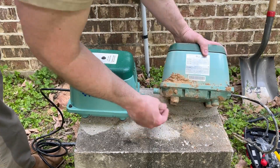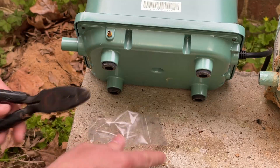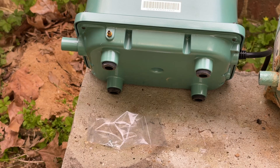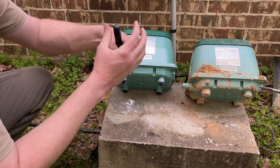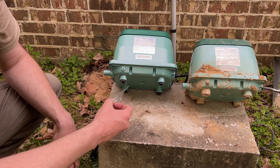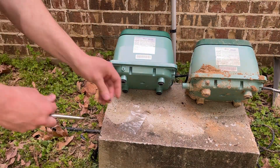On this pump on the right there is a bolt that has run into a bypass port. The new pump came with a brass fitting. If you put your finger over the main port on the left-hand side, all the air comes out that little hole in that brass fitting, and that won't work for this application. So I am going to remove the brass fitting and in its place install the factory-supplied bolt that comes in that little package. It's very small but threads in there just perfectly with a Phillips head screwdriver.